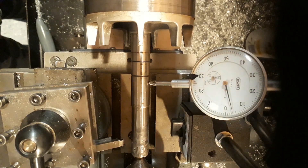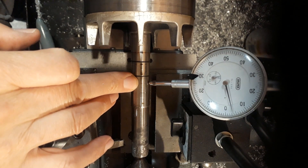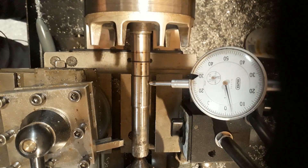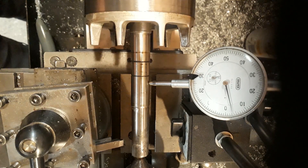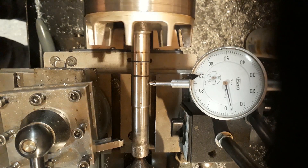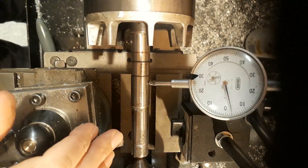I was a bit concerned about whether the center is actually true with the shaft, so I've just double-checked — set up on the bearing portion of the shaft. That doesn't look too bad to me, barely half a thou. I was thinking about whether I need to double-check the center to make sure it's not damaged, but I don't think I'm going to improve on that. So I have confidence to go ahead and continue dressing the damaged portion of the shaft, going very carefully because I don't want to take it under size.